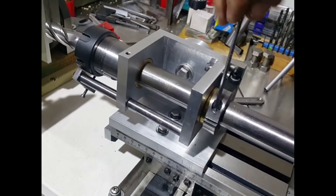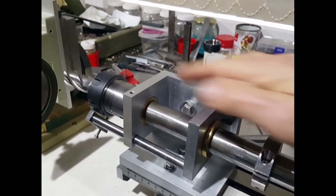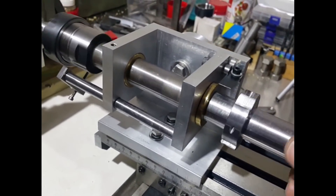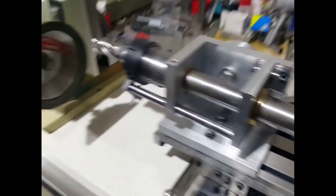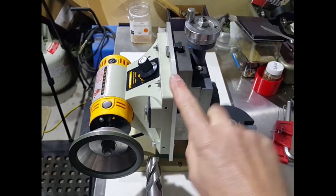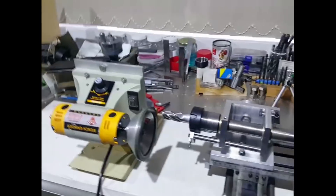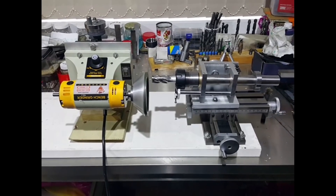The spindle itself — this is all aluminium — runs in some brass bushes, and you'll see those being machined through the various videos. That then allows us to move this in and out. Then we've got the motor mount itself — just a piece of aluminium as a back plate — and we can rotate that slightly, and then we've got the lathe milling attachment on there and just bolt it down. So anyway, that's the close-up done — we'll start the videos and you can see the processes for each of the parts I've made.